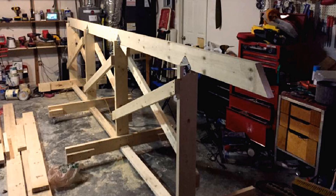Next you build a strongback, which serves as a jig to build the boat. It's typically a 2x8 on edge for this size boat. This person has elected to use wheels under the strongback — a lot of people do. A lot of people like to put casters under there so they can move it around their garage or workspace, or roll it outside. But this is what you're going to attach the frames to, to lay the boat out on.